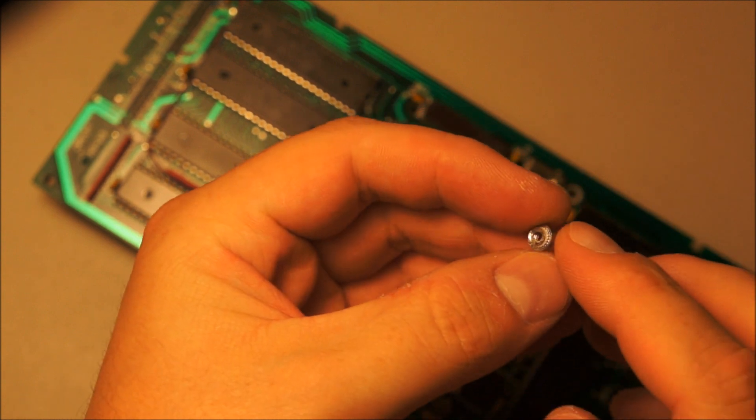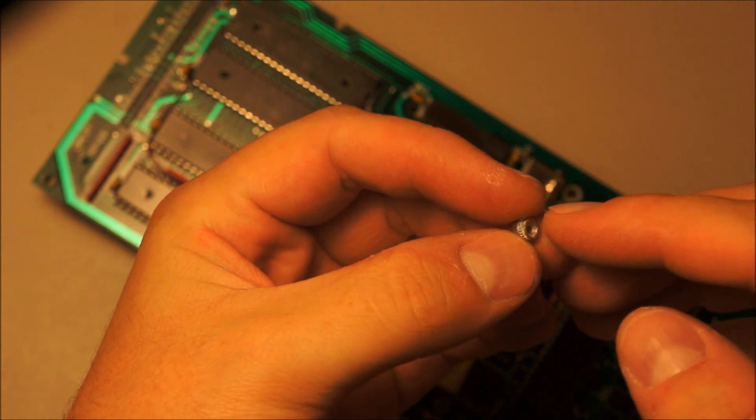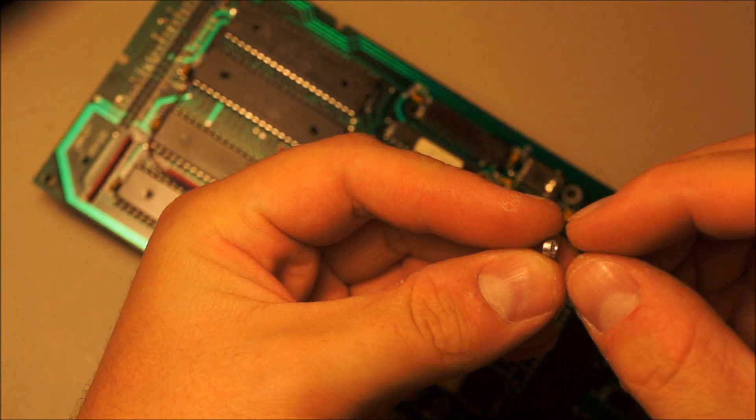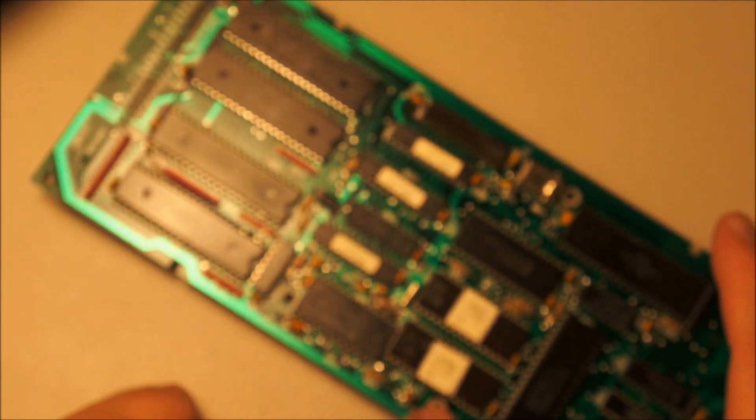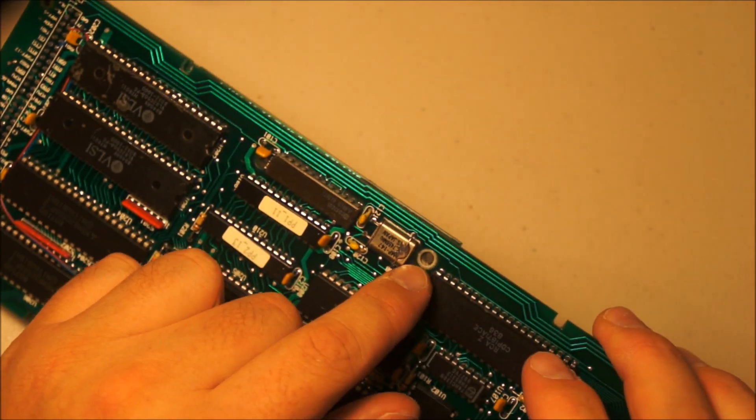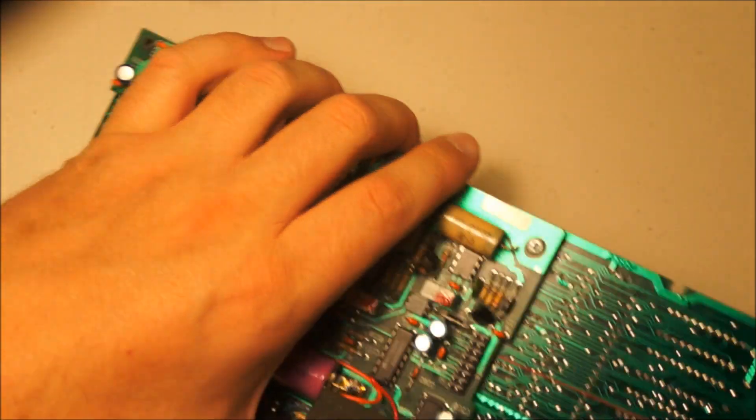You can see the way this works — it's got little teeth on it, and then you poke it through the board, and they take a V-shaped tool and shove it into that end and it causes the metal on this edge to expand and it locks it into the board. And then when it comes out of the board it tears a big nasty crater shaped gouge.